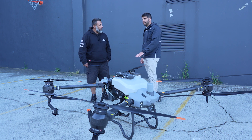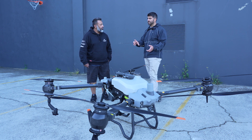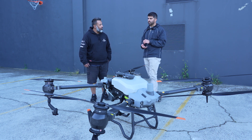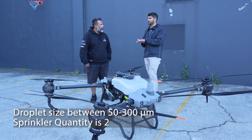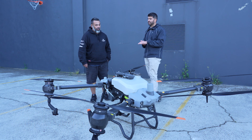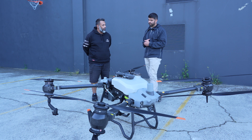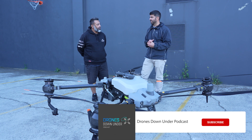So it's a lot less to clean. A lot of people have been talking about the droplet sizes between the T30 and the T40. The T40 actually comes with a second disc in the controller box — all you have to do is switch out the dual discs and add in the second disc to get a much larger droplet size. Most chemicals call for a droplet size usually above 300 microns, which helps avoid that chemical drifting onto land where it wasn't intended. You can still achieve up to a 400 micron size with these nozzles. And much less cleaning — a lot less using a toothbrush on the nozzles; just run some water and solution through them.